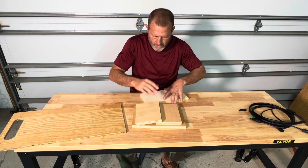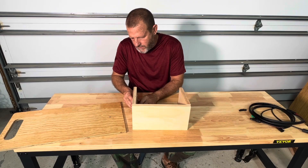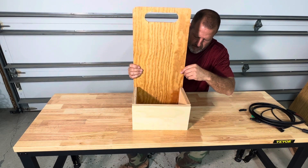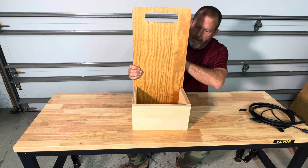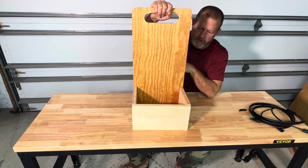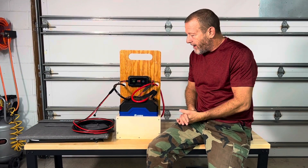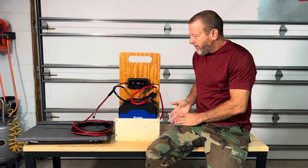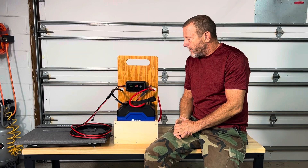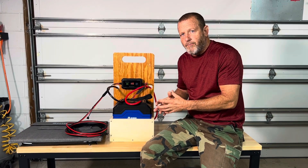I've got all the pieces cut — just a real simple setup. We're going to build a simple box; this is the back of the box. Battery's going to go in here. We're going to mount the inverter either on the front or the back, just have to see how everything lines up. We have a handle to carry it. We're going to mount the MPPT charge controller on the front or back, wire everything in. Honestly, this build probably took 30 minutes to put together. It's portable, we have the handle, we can remove the battery and put another one in. It's affordable, it's basic, it does everything it needs to do — might not be the best looking, but it's super functional and practical if you're on a budget.